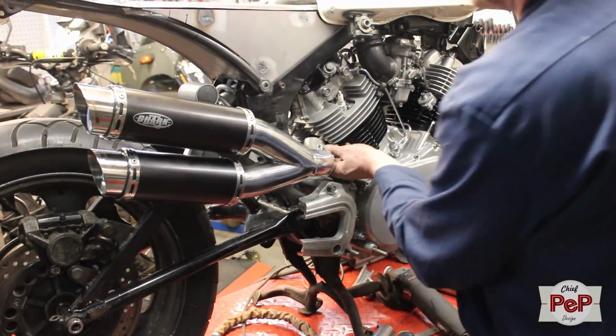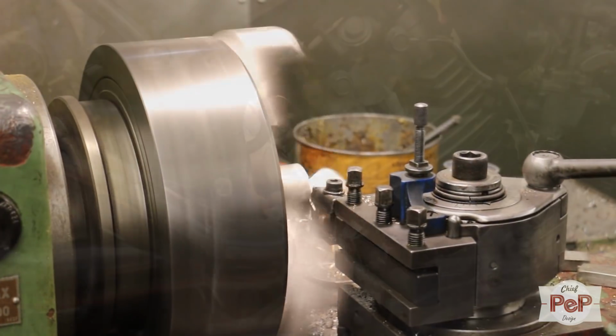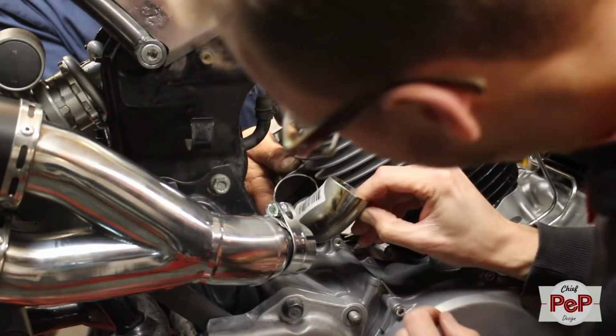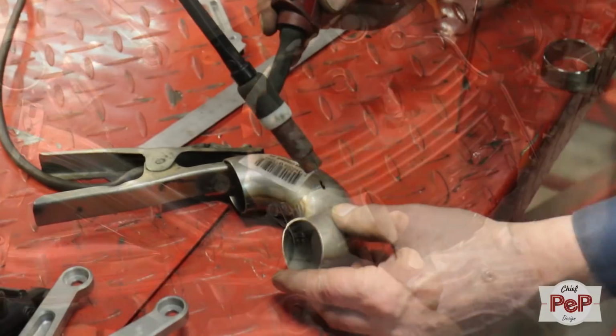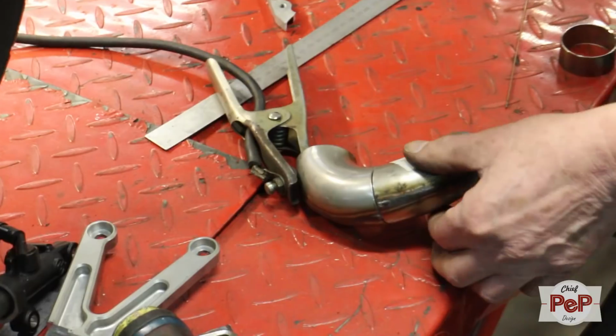The rear cylinder is the biggest challenge. We won't be going through the frame with the manifold, so you have to make a tight bend to the front straight out of the exhaust exit. You make a mark with a felt pen when the bends are in the right position. Then you know how to weld it and you're sure it's in the right angle.